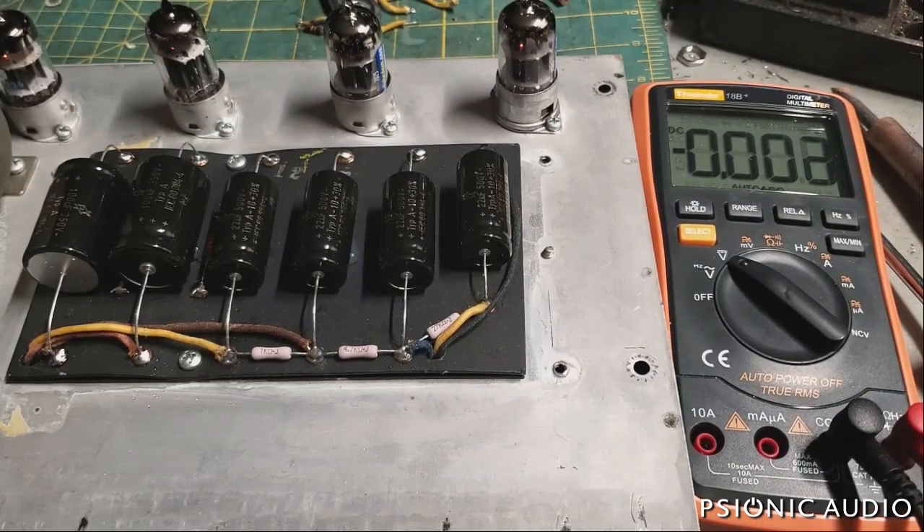You'll start to hear that as thudding when you use the standby switch, but eventually it will begin to actually arc and you can have some burned wires. That said, a new switch is $5–7. You can put 2-watt 47K resistors across them if you want to soften that. Some guys use a capacitor to soften it, just to take a little bit of stress off the switch.